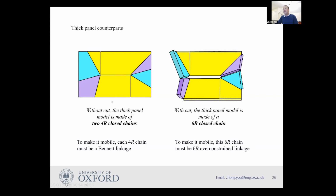And then if we want to use my method to fold it, you have to make sure around this vertex is a Bennett linkage and around this vertex is another Bennett linkage. So we have two 4R closed kinematic chains because each Bennett linkage is a 4R closed chain. However, if you decide to cut a slit, so there is no joint between two yellow panels, in this case, you end up with a 6R closed chain because we have six pieces,